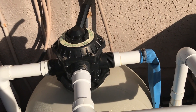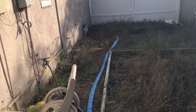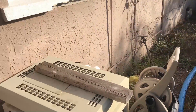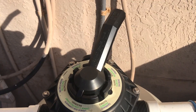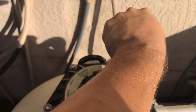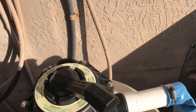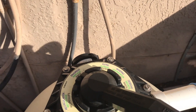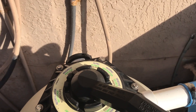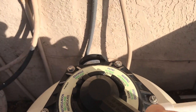You never want to go generally longer than 2 minutes, and you can check the sight glass and also check out of the hose to see if the water's coming out clear. So after you're done backwashing, go ahead and turn it off again. Then you turn it to rinse mode, which is right there, because you want to rinse all the sand out of the lines so it doesn't go right back in your pool — whatever's in the plumbing anyway. Go ahead and run that for about 30 seconds to a minute, then turn the timer off and turn it back to filter mode.